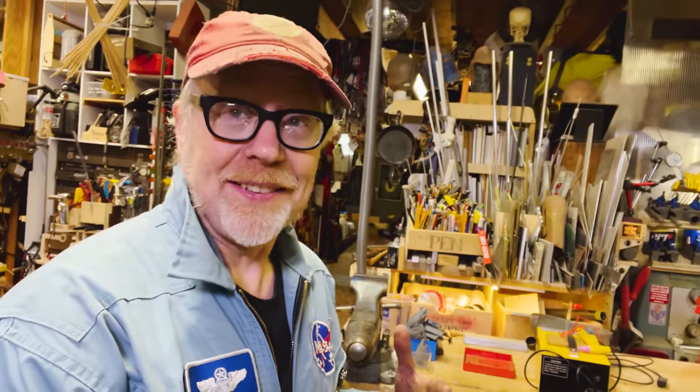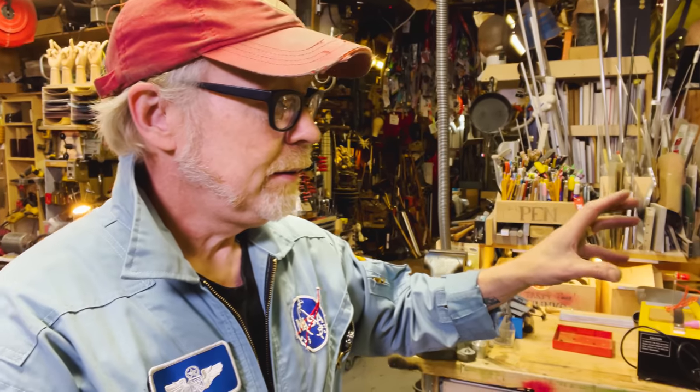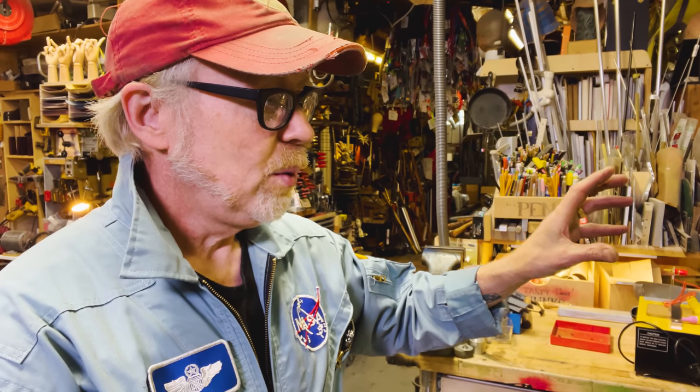But when it comes to the table saw, obviously, well, maybe not obviously to you, for the last 10 years that I've had that table saw, it just sits open, right? I haven't had a gate on it. And because of that, I have weak suction in the rest of the system because that one's always open.